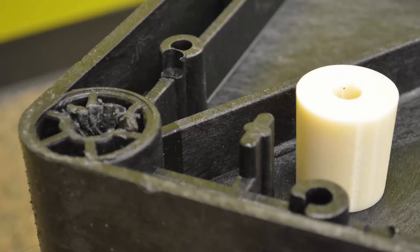On the first corner we took measurements using calipers to acquire the depth and the diameter of our shape. We used those dimensions to create a shape inside of SOLIDWORKS using draft along the depth extrusion to make a perfect fit for our part.